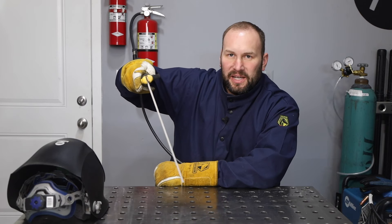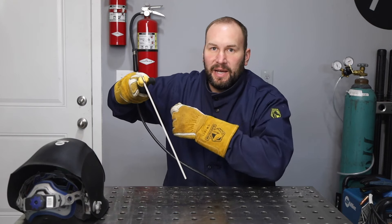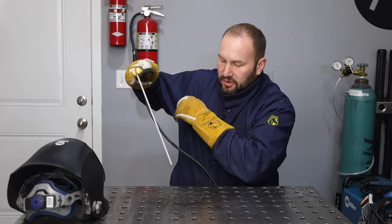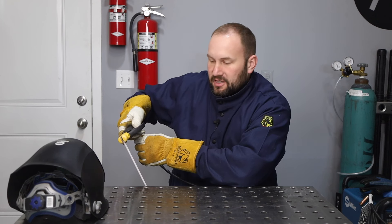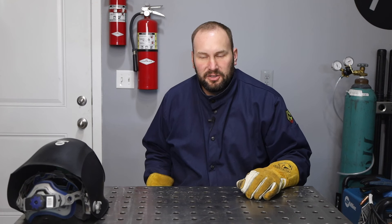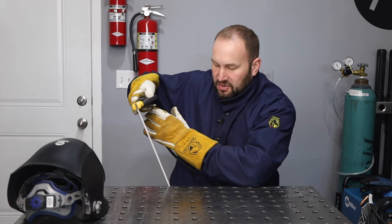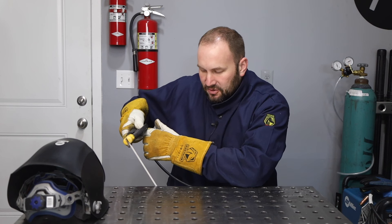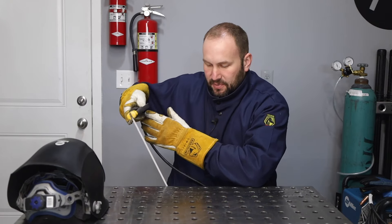When I just move my wrist a little bit, notice how much the end of that electrode moves — so anything I can do to stabilize it by propping is going to make a big difference. I like to use my elbow and my hand primarily, sometimes a pinky and thumb. As I weld along here you can see the electrode is moving in and progressing along the edge of the plate. With smaller electrodes, like a 3/32 or 2.4 millimeter electrode, sometimes you actually need to feed in more electrode than will naturally happen by just progressing along the plate — the way to do that is to collapse your fingers. As I collapse my fingers in, that allows more rod to go down into the weld than would naturally happen if I were just pivoting down.